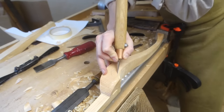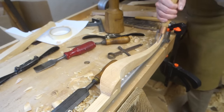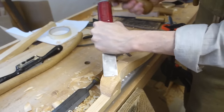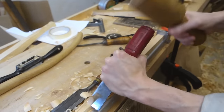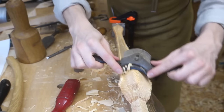My shoulder knife came in handy for deepening these cuts, and with the leg held in a bar clamp on the bench I chopped away the waste. Initially I kept the cross section of the legs very angular, then I began rounding it over with chisel and spokeshave.